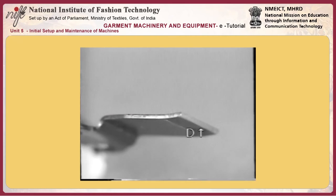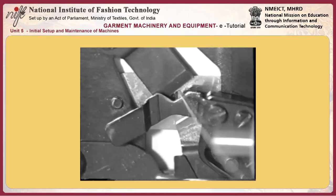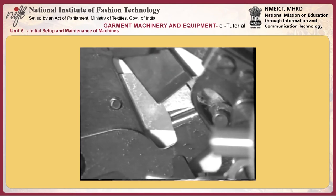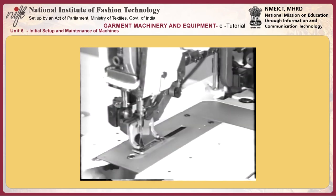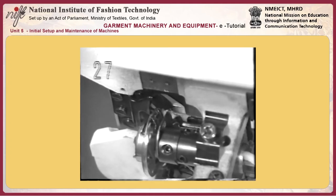23. Adjusting thread pulling wire J. The needle thread trimmer retains needle thread O at the start of sewing. If the needle thread is excessively tensed, a clearance will be produced between the needle thread and the material, causing bobbin thread A to appear on the right side of the material. To prevent such trouble, the thread pulling wire works to slacken the needle thread by 5 to 7 mm so as to produce the seam with consistent crests at the beginning of sewing.